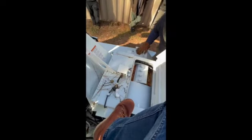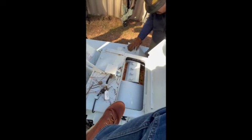Same thing, if you do that on a resharpen and then you put brand new knives back on, you need to make sure to walk that anvil back off. You'll know it right away because you won't even be able to turn the drum at that point. But if you don't, that knife kisses that anvil at 2,200 RPMs. And again, there's no telling. Talk about spinning that thing manually after you're done to make sure. Yeah, just a quick check for that, guys.